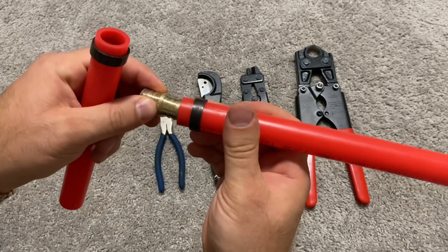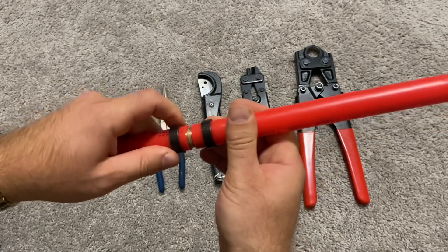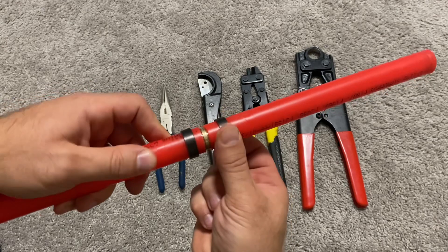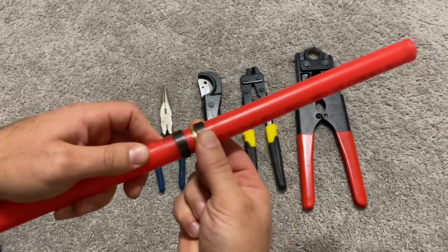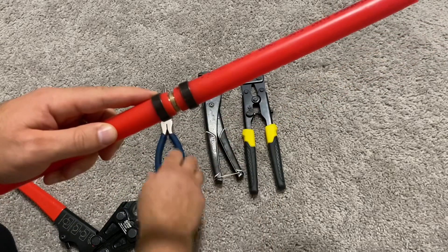Then insert our fitting. To make sure the rings don't move around while you are putting your crimping tool on the ring, it's a good idea to pinch them with needle nose pliers first — it makes them hold on to the tube and stay in place.